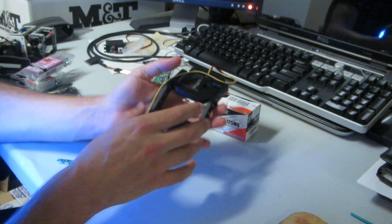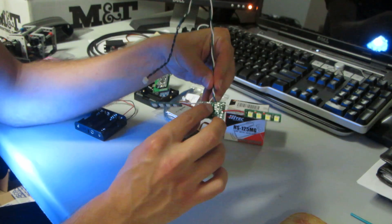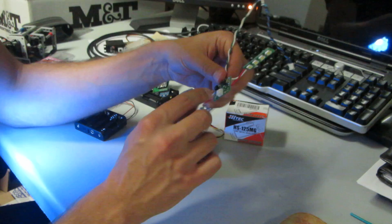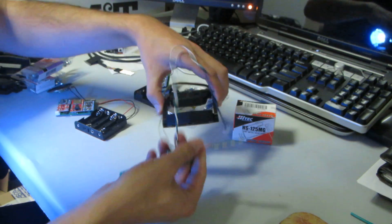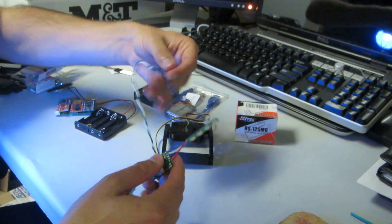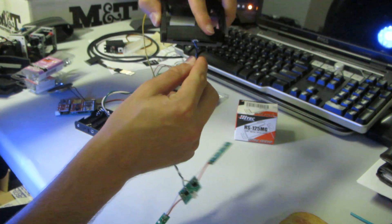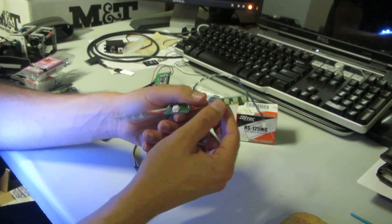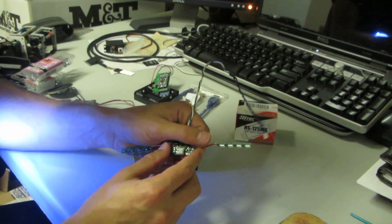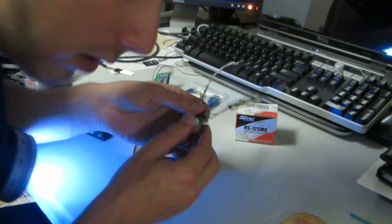If you go with the servo with lights, this is the circuit board here — you've probably seen this before. This center board mounts in the center somewhere, and I usually put the JST facing the faceplate. This servo mechanism also has a hole in the center which you can slide the JST plug for the eyes right through, which will lead back up into the helmet where the main board is. There are four LEDs on these now, and if you've got the lenses that come with this, they have four slots for the LEDs and it fully illuminates any type of lens.